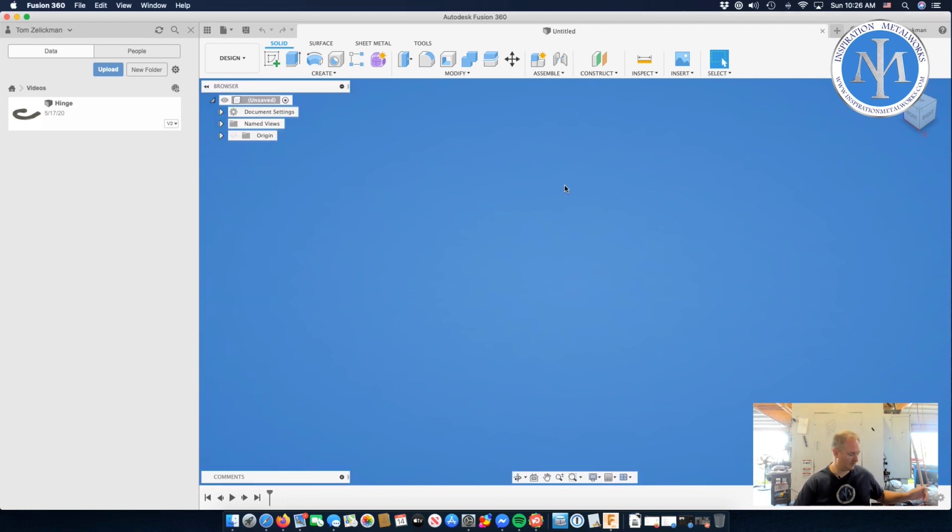Yeah, let's get started. So again, we've got this hinge. Oh yeah, there's that slot in there too, which I didn't mention. Let's just do some real basic stuff. I'm getting my rule out, and it looks like nothing is going to want to be easy on this. Okay, so it's 2 inches to the bend, and then from the center of the bend, it's 5 7/8